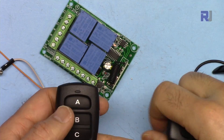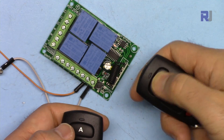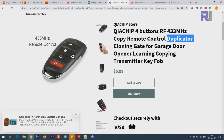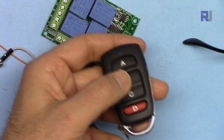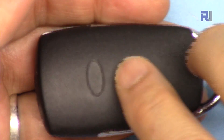If you have two remotes, only one will be programmed to the receiver. If you want to use more than one remote, you need to buy a duplicator or cloning remote. You program the receiver with the first remote, then the cloner learns from that one. You cannot program two regular remotes independently to work together.